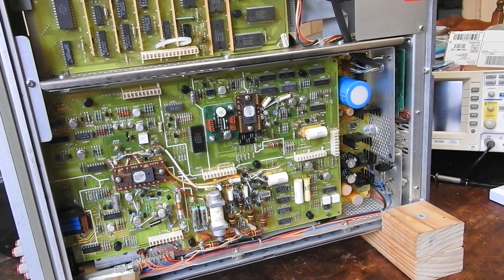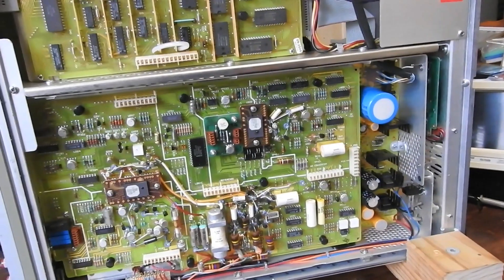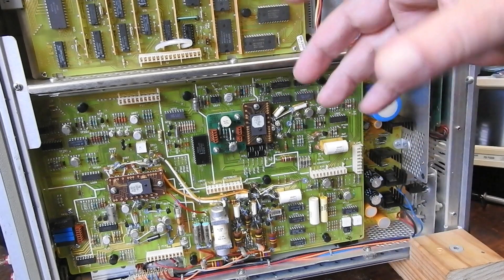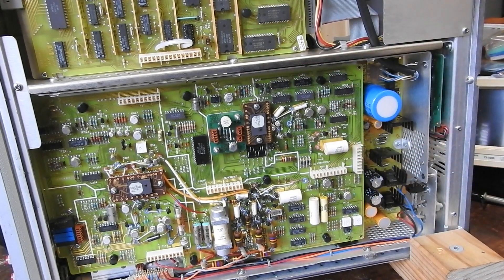I'll turn that off because I don't like it doing that. I thought let's just take a moment to admire the beauty of the engineering of these things. I'll just do a brief description of how these things are laid out. Like most bench multimeters, it has two separate electrically isolated sections called the outguard and the inguard. The outguard controls the front panel and has the external HPIB interface, and is pretty much at frame ground potential — the nought volts in the outguard is connected to the frame ground. That's also mostly digital.